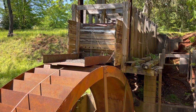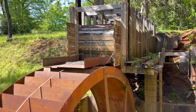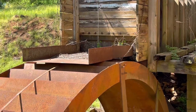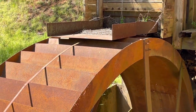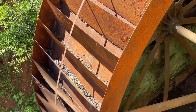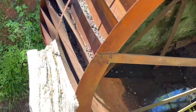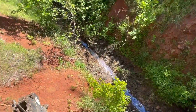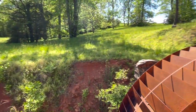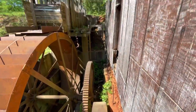This was worked on about 30 years ago, from what I understand. I imagine they built this new flume and gate and all this stuff, but a lot of it's incorrectly done — even down to when they replaced these buckets on the water wheel, they're incorrectly done and not made to function properly. The forebay is not correctly done; there are several things that aren't right. But anyway, hopefully one day this thing might have new life.